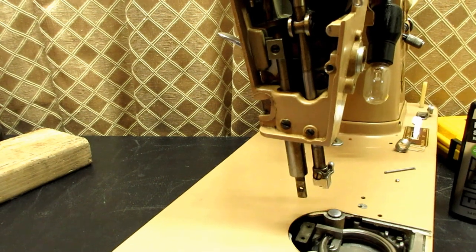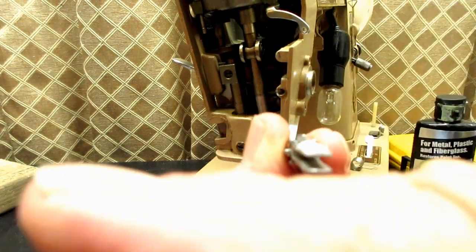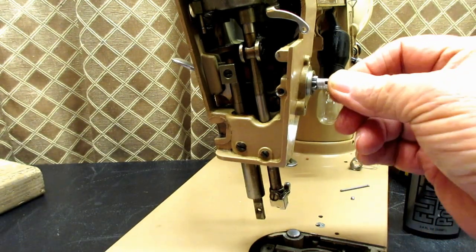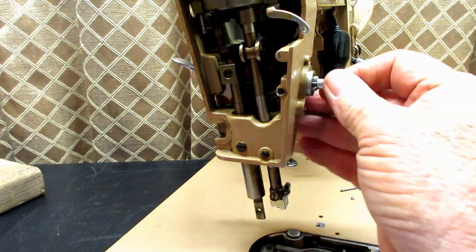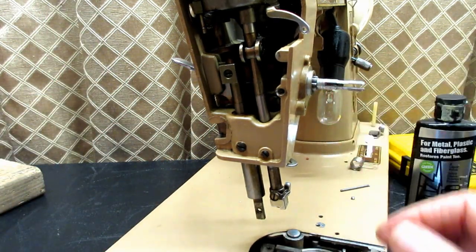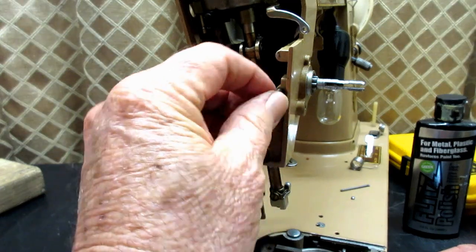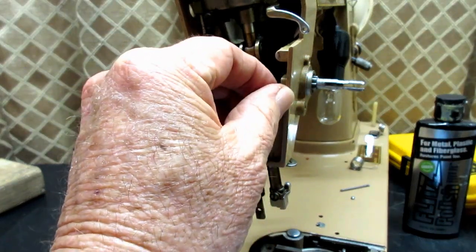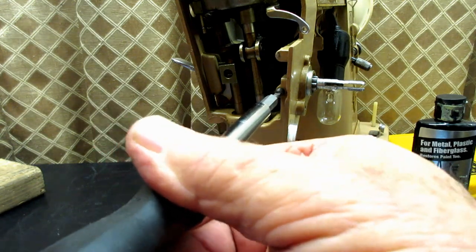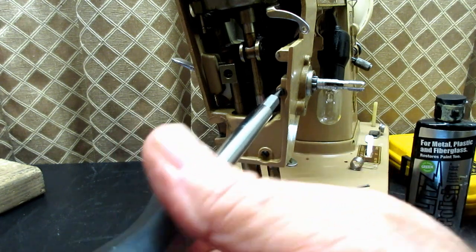When I put the tension stud on, you want it sitting so that the opening is horizontal. Put it in and twist it, and you must make sure it's all the way seated back there — you can hear it kind of hit the back. Then I'll get my set screw started and install it in there. That set screw goes in at a 90-degree angle to the stud and tightens up against it — that's what keeps your stud in and keeps it from turning.